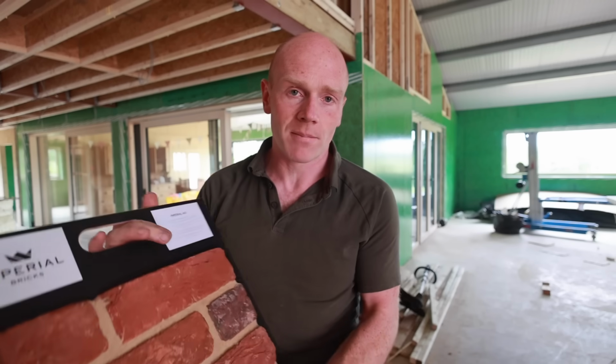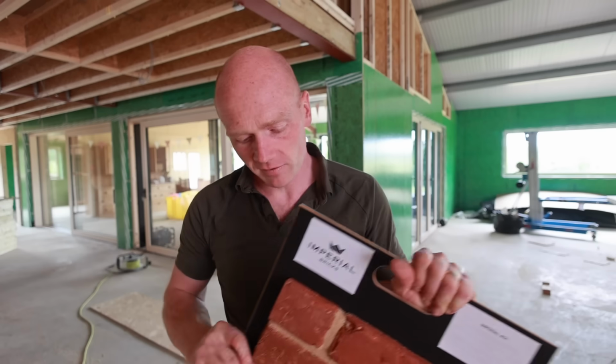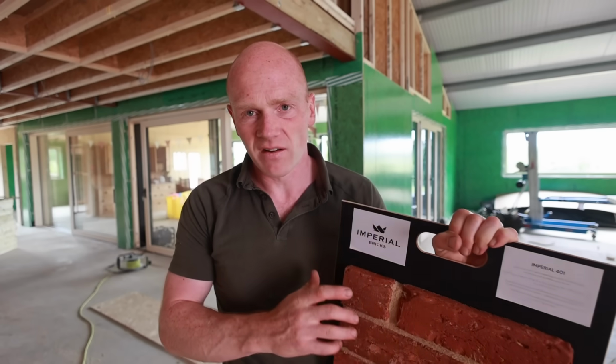So we could go for that, because bear in mind we haven't got any brick ties or brick coursing, or block coursing I should say, to match. We haven't got any existing bricks to tie into, we are putting all of our brick ties onto our battens wherever we want them. So we could go with imperial sizes and it shouldn't really matter. And equally, I kind of like the height of them. Plus, because they're a reclaimed tumbled brick, there's a bit of variation anyway.